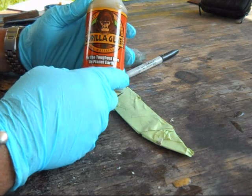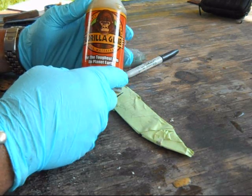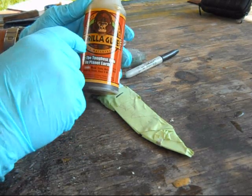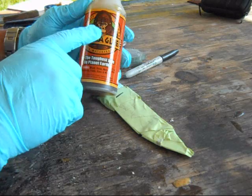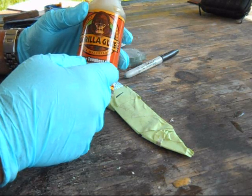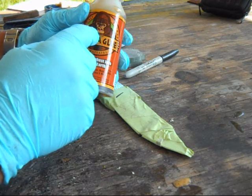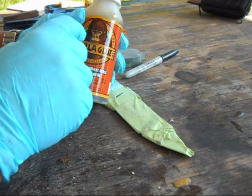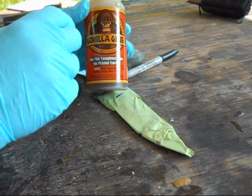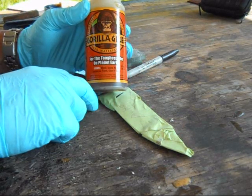A lot of people use epoxy. There's various kinds of epoxy. What I have found personally, because when I first started making knives, I didn't have carbide bits, so I wasn't able to pin them. You have to pin your handles. You have to use adhesive on your handles. Once you do those 2 steps, then you're fine.